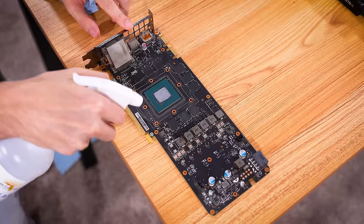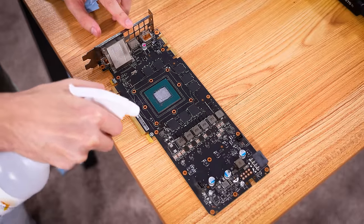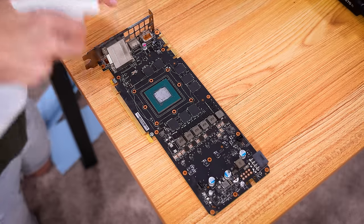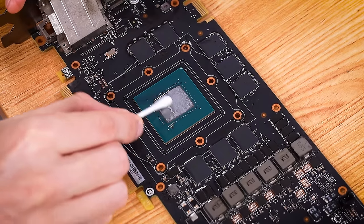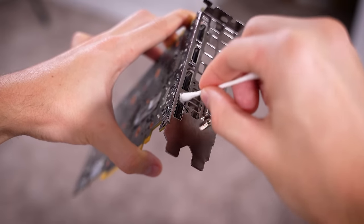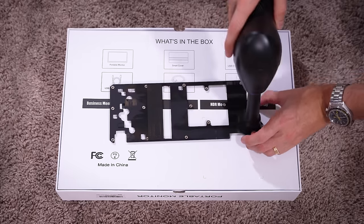I'm going to douse this entire card in excess IPA — it's not normally what I do, but we're just going to flood everything. We'll dry it all up with some shop towels and Q-tips. We'll especially focus on the GPU area here and make sure we get all this thermal paste up. It's not super chalky — I noticed that when I removed the cooler, so that's good, it means the paste wasn't trashed. We'll focus on a little bit of everything with this board and give it a best shot.